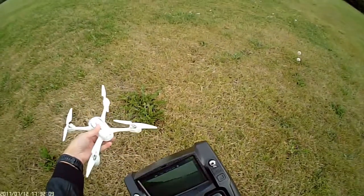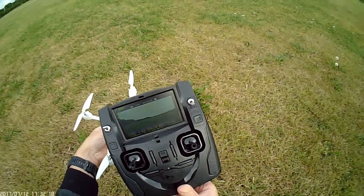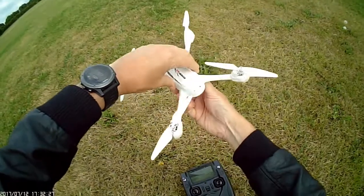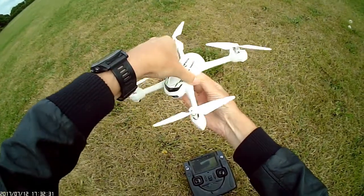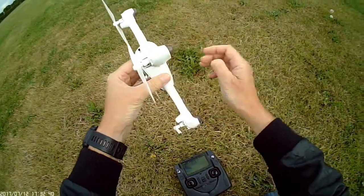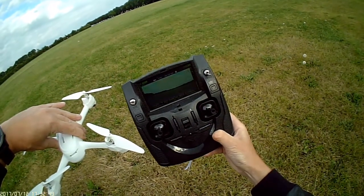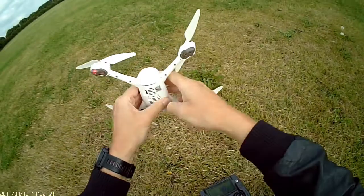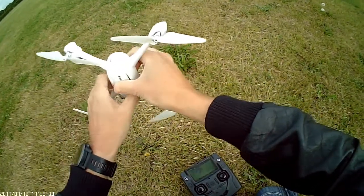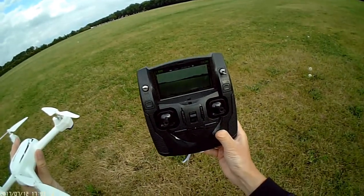On the screen you can see the image — it's in yellow writing which says 'Calibrate Compass 1.' What you do is literally turn the quadcopter around and keep turning it until it says 'Calibrate Compass 2.' Do it nice and slowly. Take your time because if you do it quickly it won't work in follow-me mode. Then you turn it down and rotate it around again — nice and slowly, probably about two or three rotations until it's satisfied. Once complete, nothing is mentioned on the display.